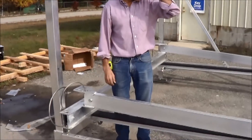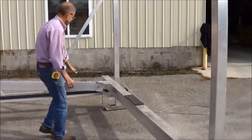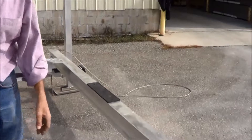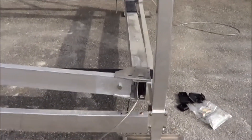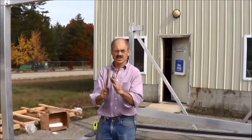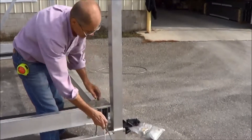I've got the twin beams where they belong — the front one and the rear one. The front-to-back members: there's going to be a left and a right. The left one by the winch should have a winch marked on the plate. The front-to-backs are going to have the larger plate on the top and the smaller plate on the bottom. You're going to want to kind of just put these together like it's going to go together for right now. Any of the long studs go up; any of the short ones go down.